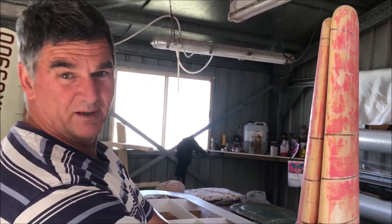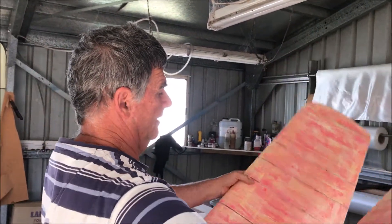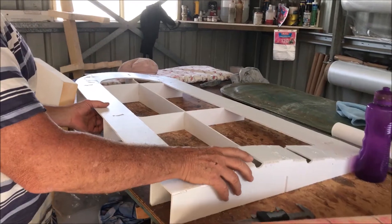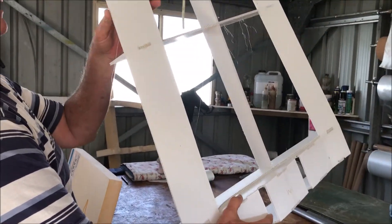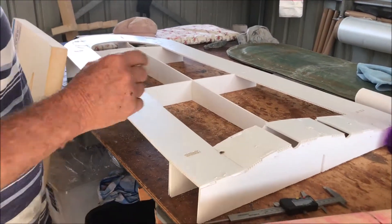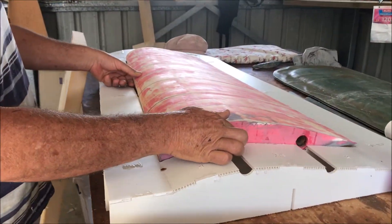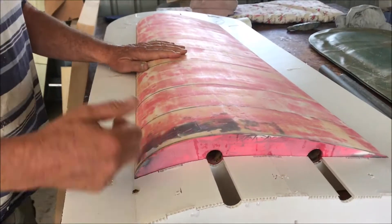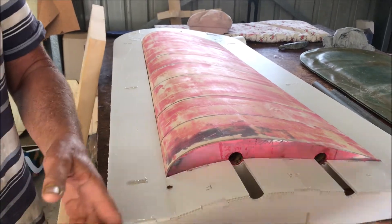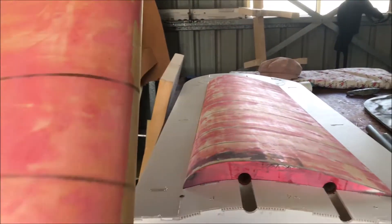Three or four mils we could live with, but that's just way too much. When we go to make the parting board for the mold for these wings, we make it out of core flute and it's all cut on the CNC so the angles and shapes all fit - so the wing can sit perfectly in this little cradle with wing tubes up here, and then we make a mold over the top. But when we went to do this wing we found it was totally a different, too-short size.